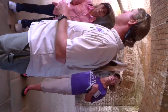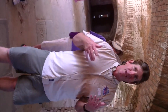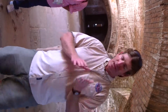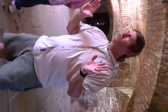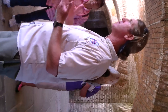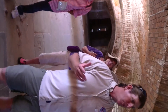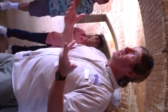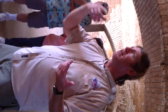The problem is in the building materials. The core of this fort is concrete and the exterior facade is brick. They sandwiched these large iron plates in between the two to balance these shutter doors. Well, when they oxidize, they can expand to over 60% of their original size, basically just pushing the brick right off the wall. The core then becomes exposed and is degraded by the elements — wind, rain, and water. That's what the video also talked about: the restoration process done to the wall.